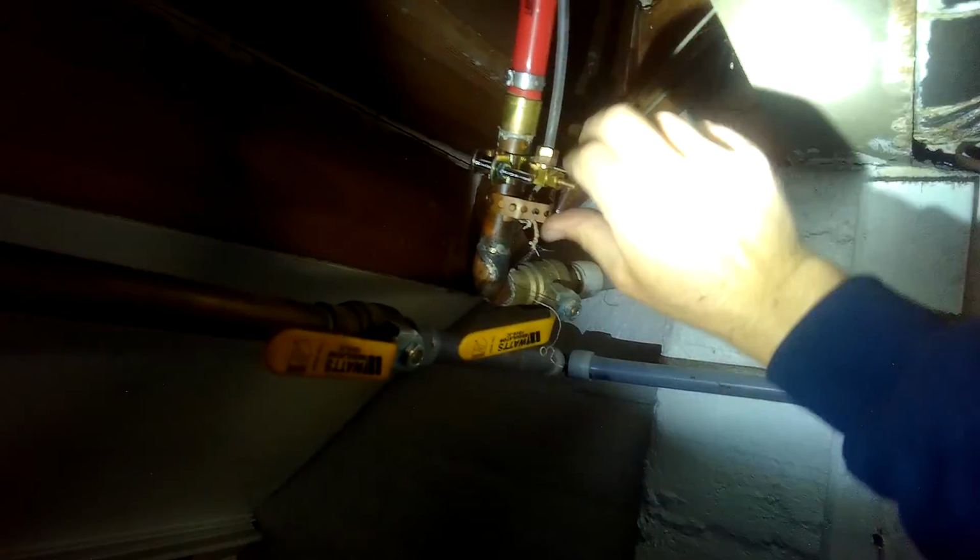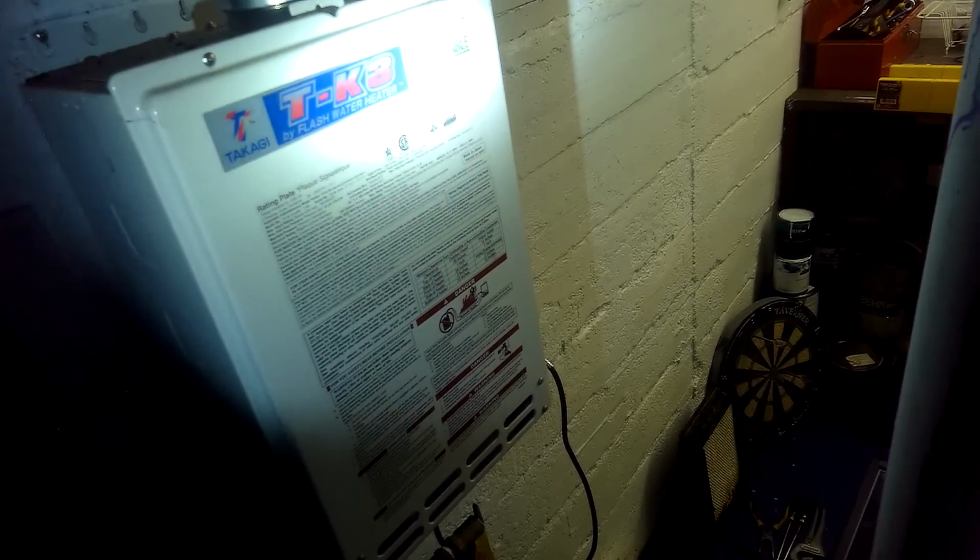Let's check that water line. Goes over there. Right over here with this plastic tubing to the saddle valve. Let's just close this. Don't want it going freely. Yeah, this keeps getting better here. We got isolation valves with the expansion packs. No flush valves on it. Let me tell you, this is Valley Stream. Very high amounts of hardness and iron in the water. You gotta be able to flush this thing out. But that's closed now, the saddle valve. Alright. Let's go give them an update.